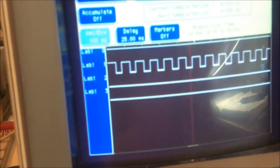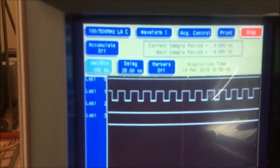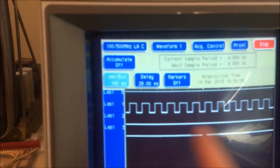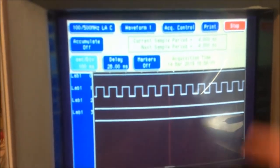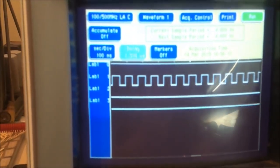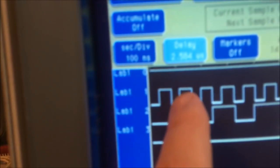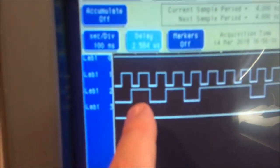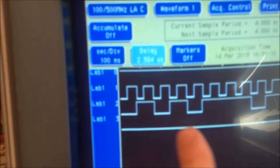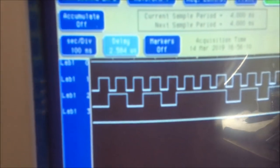Alright, let's hold on a second. I don't want to use the trigger or nothing. I'm just going to wait for it. You can see there's no activity on line 3 on the output. But just to make sure, let's just go ahead and use the delay. Okay, here we go. We have some waveforms here. There's a rising edge of the clock and it's high. So this should definitely have toggled right here. It's just absolutely missing a data signal.